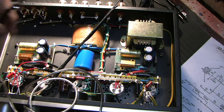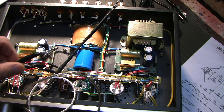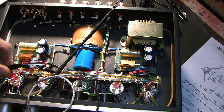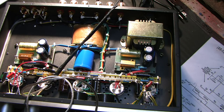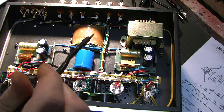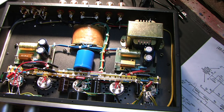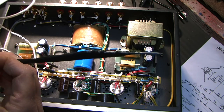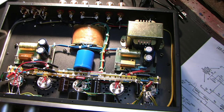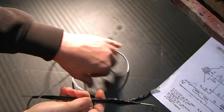When you touch and complete a circuit across a 900-volt, 400-volt, or 500-volt capacitor, you're going to get one heck of a shock and it's potentially deadly. Therefore, discharging a capacitor should be done with one hand, with your hand far enough away that there's no chance you can be touching two places at once in the circuit. The way to do that is a probe with a wire, an inline resistor, and an alligator clip.